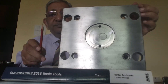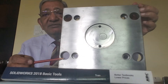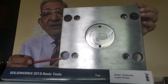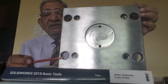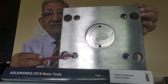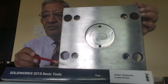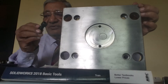These big holes are clear holes. They are used for aligning the front plate with the cavity plate through the spigot of the guide pillar — that you will see when we do the assembly. These counter bore holes are used to assemble the front plate with the cavity plate through the socket head cap screw.